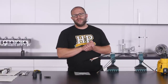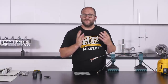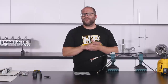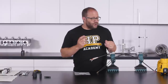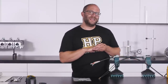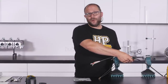Going a little bit above the specified temperature can give a slightly better result, as these boots take more time than standard heat shrink to fully recover. If you go above the listed temperature, don't stray by more than about 10–15% and ensure you're not charring or scorching the boot. For this application, the heat gun is set to 270 degrees Celsius, which should allow easy control to get the boot shrunk into place.